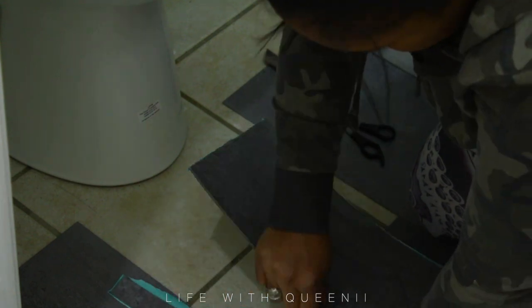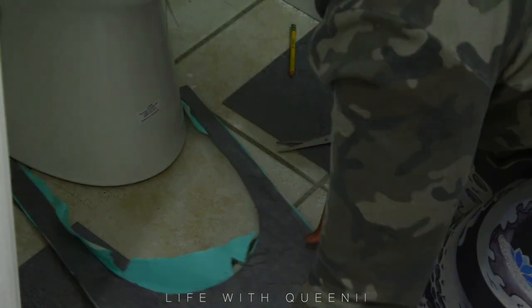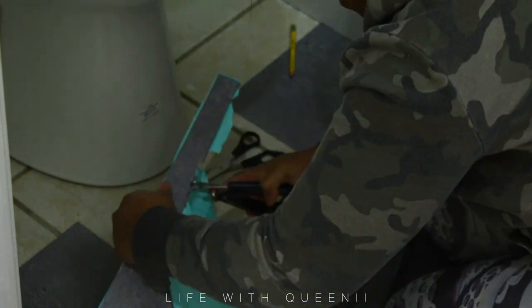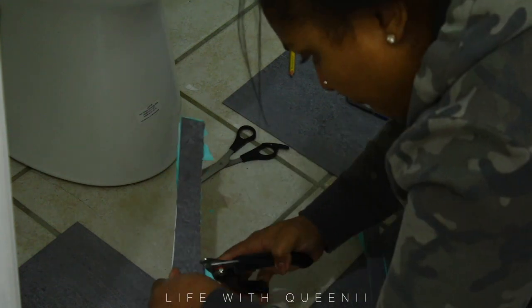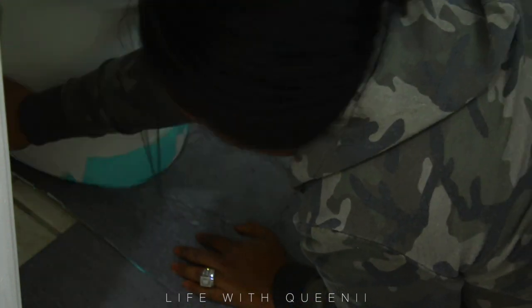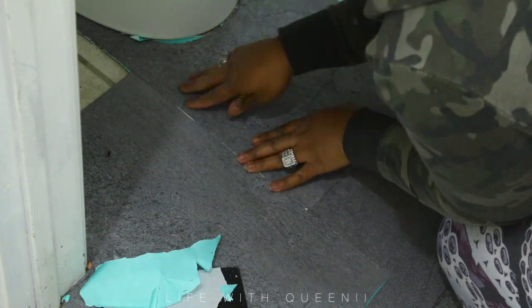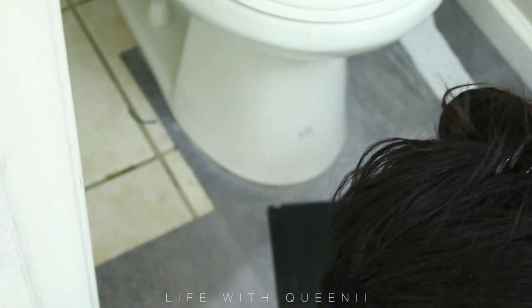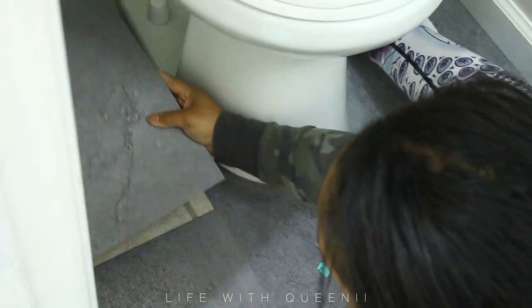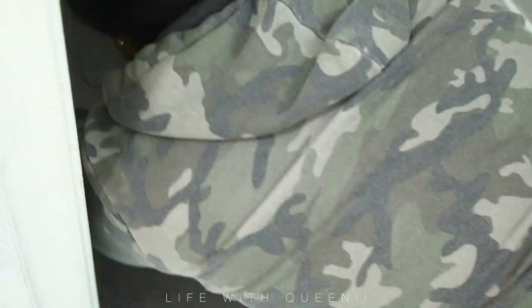As you can see, I'm using my box cutter to cut out my shape. Don't cut until you're a hundred percent sure you're at least 90% there — you can always go back and remove just a little bit. Then once that's done, it fits perfectly. Sometimes you can just loosen the screws on your toilet to slide your tile under there, but doing that can separate your wax ring, which can cause a really bad leak. So don't do that — if you're not a plumber or don't have someone who can do plumbing, don't do that. That's why I just ran around the toilet — my back still hurts from giving birth, so I'm not picking up my toilet.